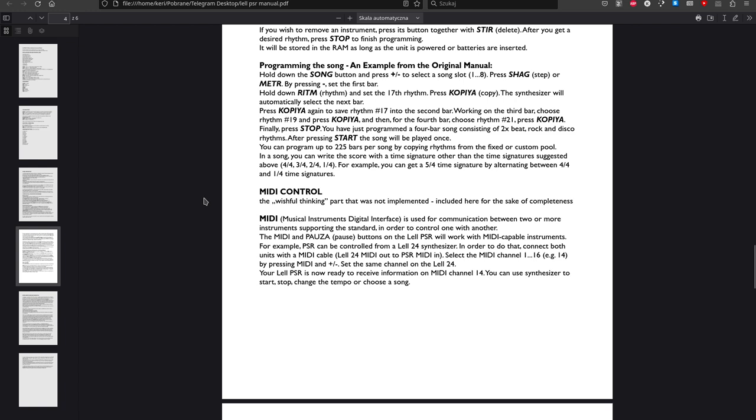I noticed when reading the information I was working with from Edward Ditek and Dmitry Dubrovenko that the PSR never really had the MIDI interface. They were working on it. It was implemented in the PCB design, but it was never implemented in the firmware, unless the MIDI control routines were coded on another missing ROM chip, because it was possible to extend the control firmware to 27C16 EEPROM chips.